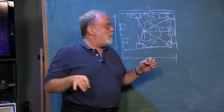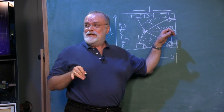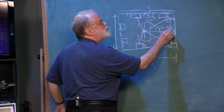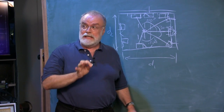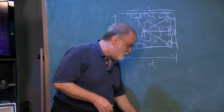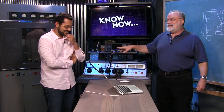You mentioned delays earlier. If a speaker is farther away, you want its signal to be delayed less than if a speaker is closer, so that the time it takes the sound to arrive from this one to your position and this one to your position is the same. That's the issue of delay. Now, you finish that up. Basically, it's a very loud process, so what I do is I hit go and I leave the room because it's loud.